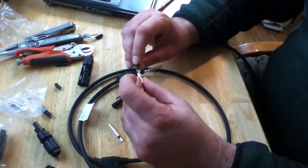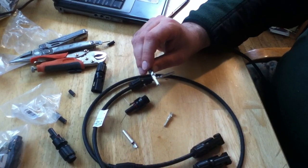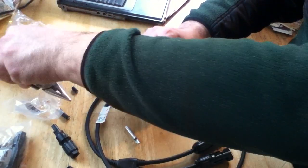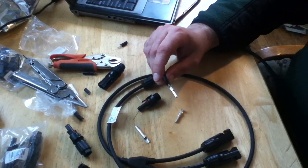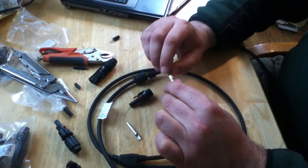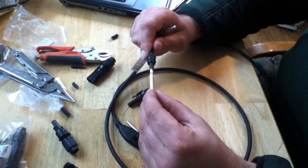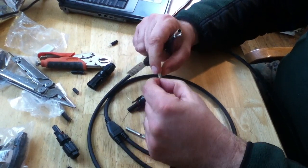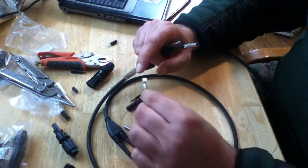On 99 out of 100 of these designs you're going to have two little tabs. If you're bending this by hand with a crimper, Leatherman tool, or vice grip, you'll want to get it really nice and tight — tightness gives you a higher quality connection. Some people will solder at this point but that's still relatively rare. You don't want to fold both tabs at once. Fold one, then fold the other one over it, and then tighten everything. Also give a pinch at the little area right between the shaft and the ears.